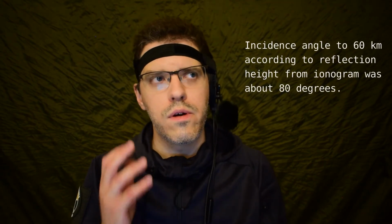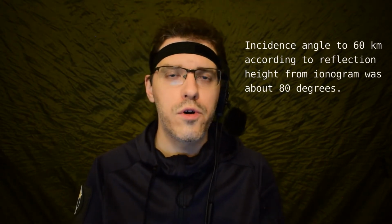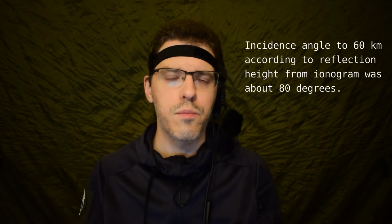So what I had the possibility to do was to monitor what happened with the signal that I transmitted by looking at the Kiwi SDR station on the internet, which is really nice with these Kiwi SDR stations, and there are so many of them now around the world that you can experiment with stuff like this, which you could not really do in the past. So on the 160-meter band I don't really remember what the signal strength was, but it was fully usable on CW anyway, on 20 watts.